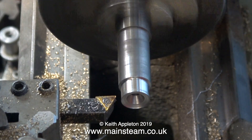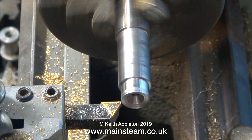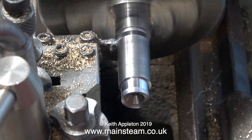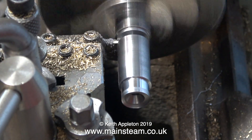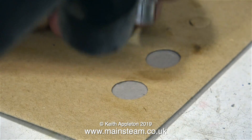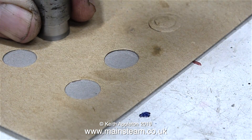The very last turning operation with the boring tool just lifted the edge outwards a bit. Here I'm just cleaning it up with a normal lathe tool, and it's very sharp indeed. All that remains is to part it off, but I'm not going to let it fall into the chip tray as that may damage the edge. Here's the finished tool in action — it's really good. It cuts very nice, clean, 9/16th of an inch diameter holes in the brown paper.